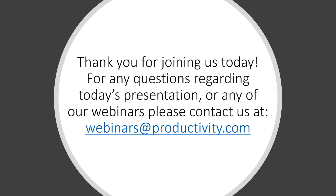Okay, thank you. Ed is asking, just to add, make and save probe programs, especially for parts that are the same setup like upper left, and also for a face mill to have the rotate parameter set. I think that was kind of a follow-up to what he was asking before. Okay.